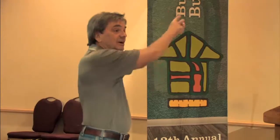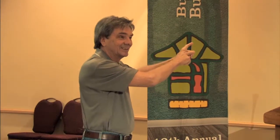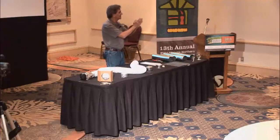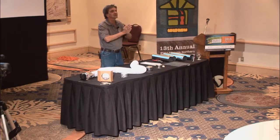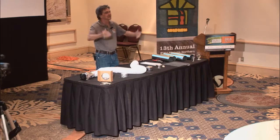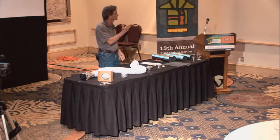This is a traditional heating system that you'll find in many houses where you have a basement, where basically your heating system is throwing hot air under the window. And for years I preached to everybody, why is the grill under the window? It's because the window is the poorest part of the wall. It needs the most heat. Don't cover it with all kinds of blinds because it'll just get full of water. You see, the moisture will get there, but the heat won't get there. So that's why we flow it up.